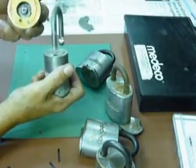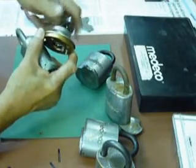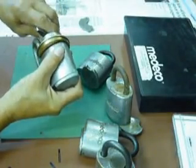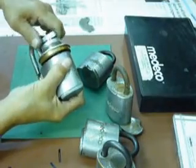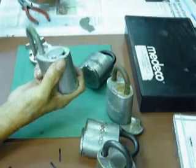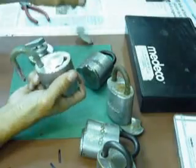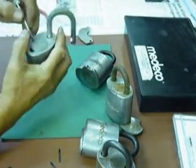This other one is pure brass — I don't know where it is made. This is where my fabricated tool is applicable, because you cannot remove that cover with the magnet. There are lots of padlocks here which need re-keying. You turn it and it's already in position. Since it cannot be magnetized — it's full brass, no inserts — all you have to do is just pry it.